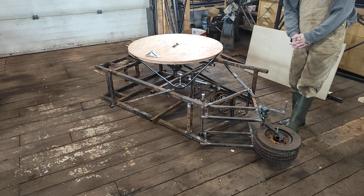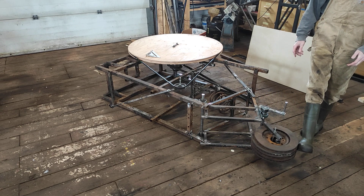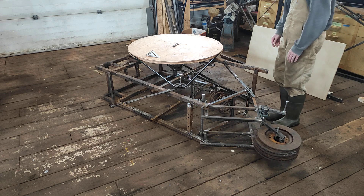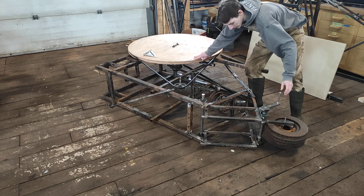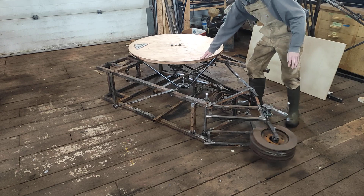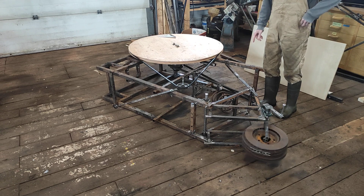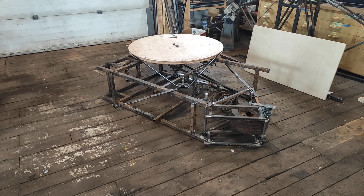A spinning weight is an inertial drive — it's that simple. But it doesn't work that well when the center is moving; it works best when the center is not moving that much. So it works really well when there's lots of load on this wheel, so the center can't move very much. You want brake pulleys so you can gear it out to a fast speed with minimal frictional losses, because there's a lot of resistance.